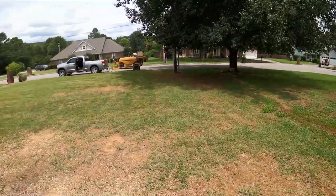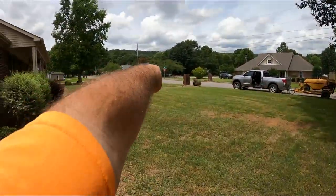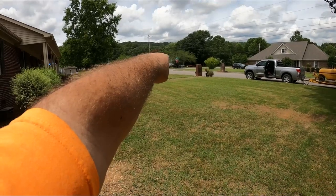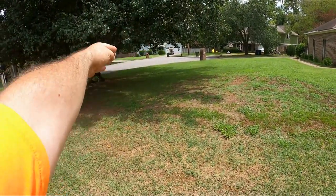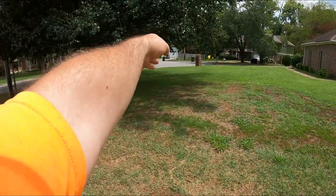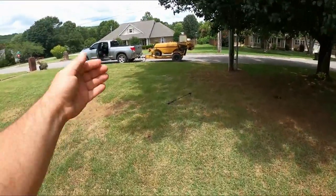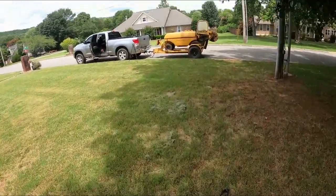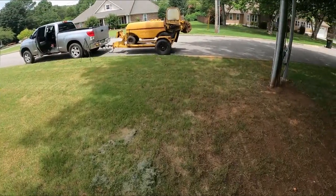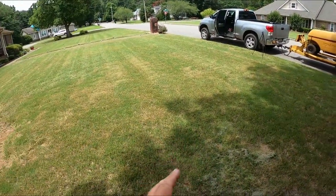Well, this is in a cul-de-sac. So if I walk out here and walk over there and the water valves are on that side of the road, then I could tell the water main is on the other side of the road, runs down into the cul-de-sac and stops right there where the fire hydrant is. So that would make the gas main on this side of the road. And in my area, they got two different gas companies.